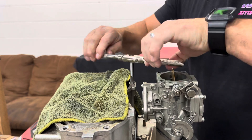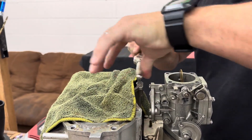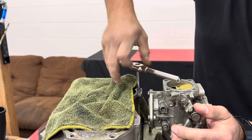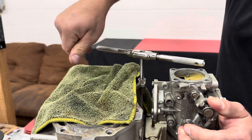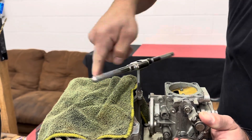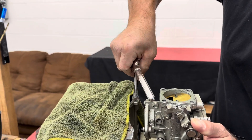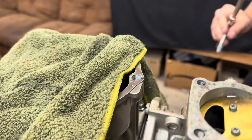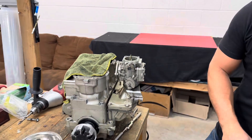I'm still going nice and gentle. The tap's all the way down now, so we just back it out nice and easy. You can see the inside of that hole is now tapped for the pitch we need to put the coil in. Go ahead and repeat what we did before and suck it out with the vacuum.